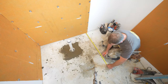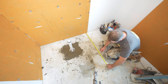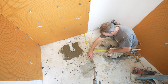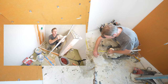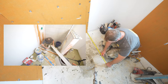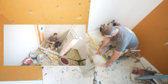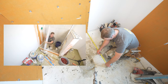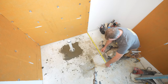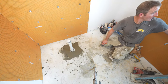So we want to overhang our curb about an inch at the minimum, because you want to have that curb top be able to straddle the curb itself and then also just butt right into a wall. So my whole knee wall, by the time I'm finished, is going to be 42 inches outside of a 34-inch pan. So let's go ahead with the anchors that I'm going to be putting in. We'll make our bottom plate 40 inches, and then we'll add on a 2x4.